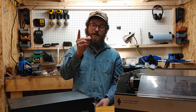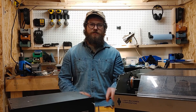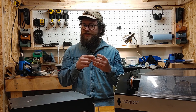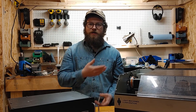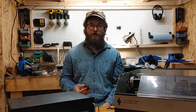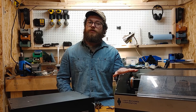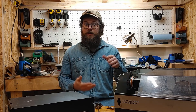I can pitch this little guy in the scrap bin where he belongs. You may have noticed a couple things that made you scratch your head, especially if you watched the last video. First off, I used my mill to drill a hole in the center of this round part — a job that seems like an ideal task for a lathe. The issue is tool holding; this little tool post is the only tooling I have. So I'm going to need to get some tooling and some tool holding before I can really get things running as I would like on this machine.